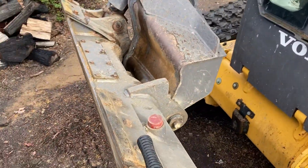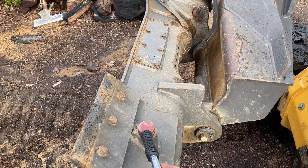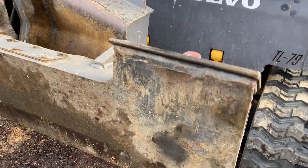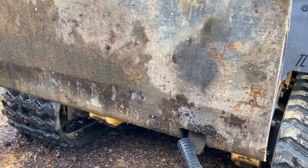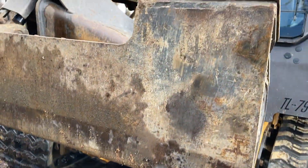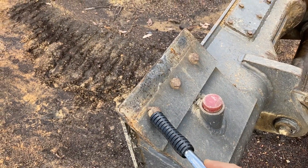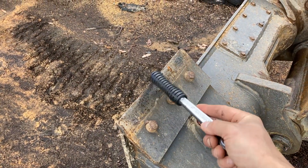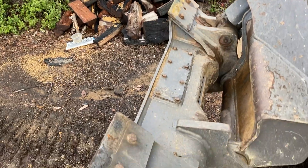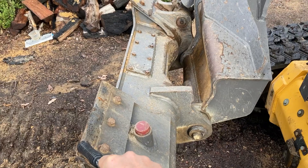This is the quick attach. That one is hydraulic, so it's controlled by a button inside. You can see here this indicator tells you that it's partially open, and in here you can see the little pins that go inside. The bucket or any attachment is attached between those pins and those edges. On this machine, those edges are flippable — this plate here can be flipped to expose a new edge. I don't know how often those things wear out, probably not that often.